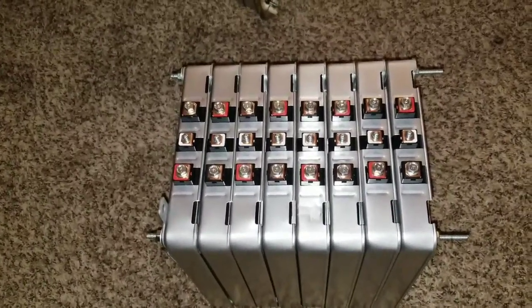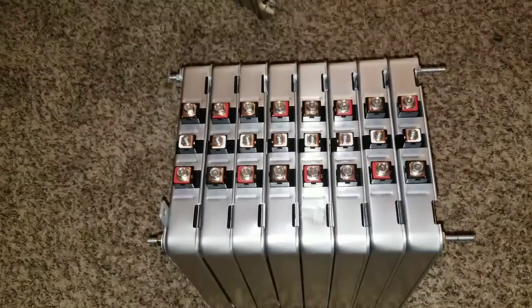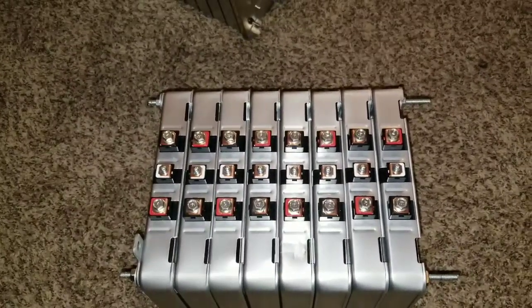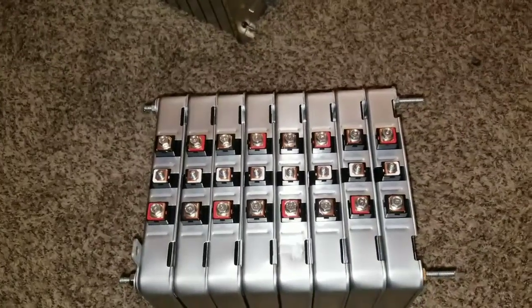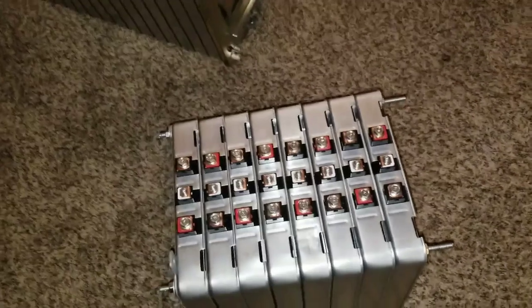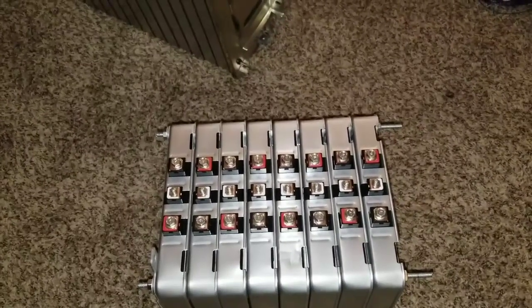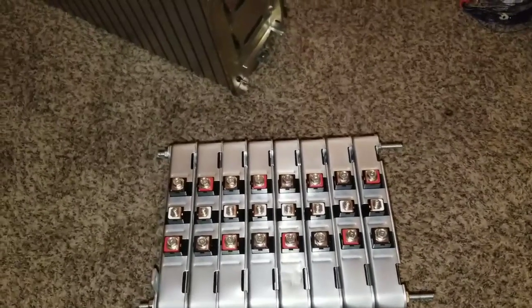One string has, I think, 1200 and something amp hours on one inverter, and the other one has only about 630 amp hours, which is AGM batteries with the VMAX. So now he's going to take the rest of the batteries and pour them into 1 PIP, because he didn't parallel those. So he runs individually. That's how he runs his house. 1 PIP is running the upper side, the other one is running the lower side.